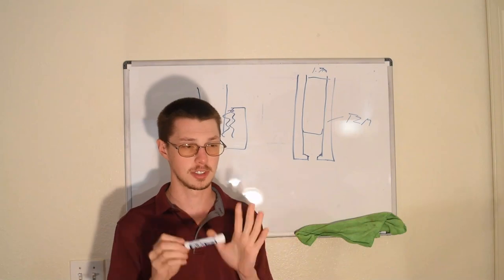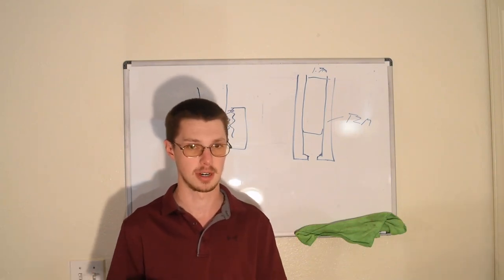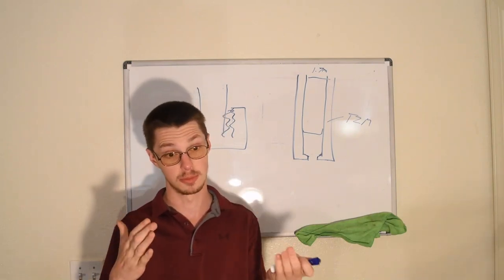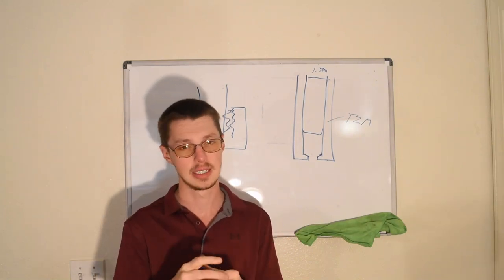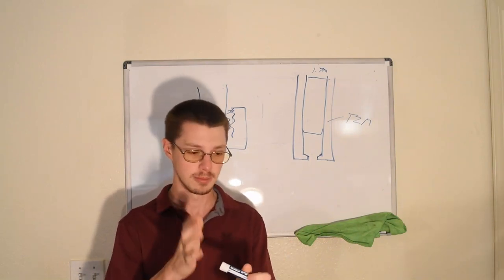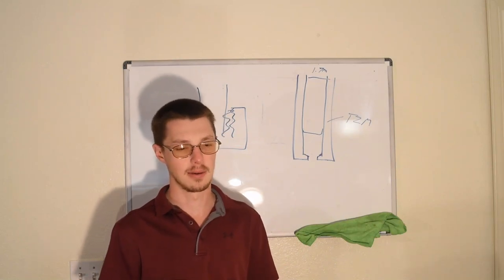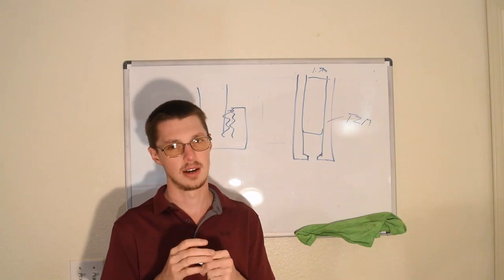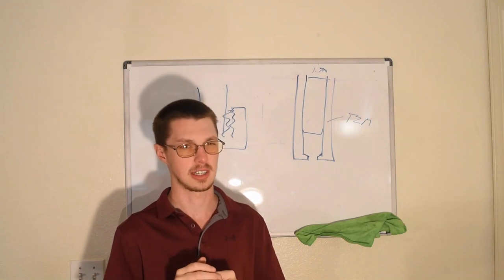And so this is interesting because it essentially inhibits the solvation of molybdenum into the melt of other metals, but it also makes it so that van der Waals force is the primary method through which molybdenum surfaces and the molten metals, or viscoplastic metals in our case, interact, which essentially has the same effect as Teflon. The molten metals will slide more or less along the surface with relatively low friction, and without necessarily introducing any kind of chemical reaction. There won't be necessarily room for a brittle intermetallic or something like that to form.